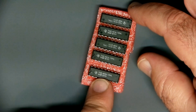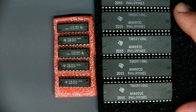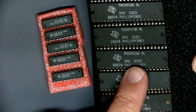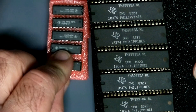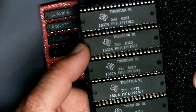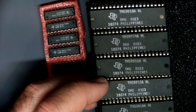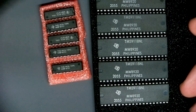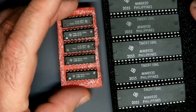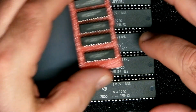The 4416 is four bits wide on the data bus, so I only need two of these chips to team up with the 9118s. There's a lot of talk online about people using the 9918s, but those are designed to be teamed up with eight one-bit DRAMs. You can also find circuitry to interface them to static RAMs using two or three additional chips, but these are basically the same price so I got both just in case — about 20 bucks. In the end, one VDP and two of these DRAM chips for the whole circuit seems reasonable.